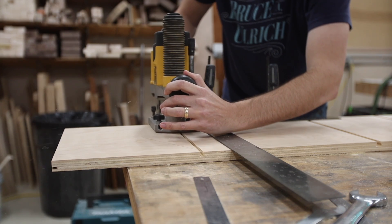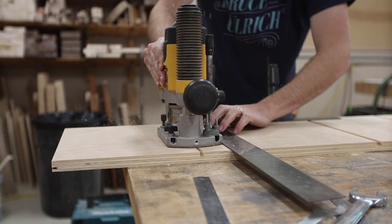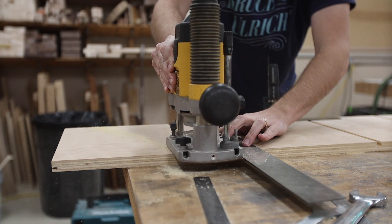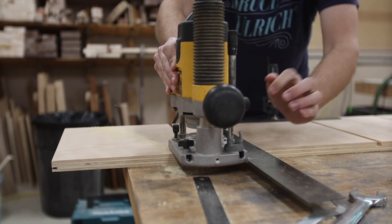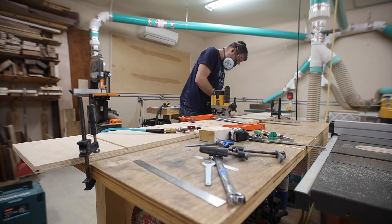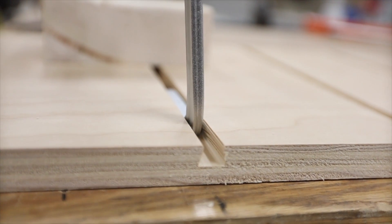I've got the preliminary grooves cut with the quarter inch bit — just to make the dovetail bit not want to wander and not work as hard. I cut them to the same depth and then went back to line up the dovetail bit as best I could. The reason this worked is the final dovetail bit was slightly wider than the quarter inch bit, so as long as I lined up my straight edge 90 degrees to the edge I could just sight in where I needed to cut. The Micro Jig bit leaves a nice clean edge — there's a slight round over at the top and it cleaned up all the fuzzies left by the other bit, with no sanding needed.